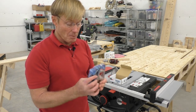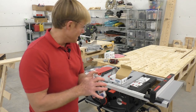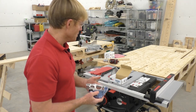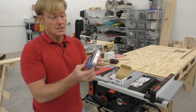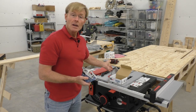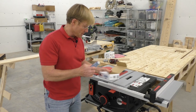These are obviously one-time use — they plug in. Once they come in contact with the blade, it damages the blade and the cartridge. But then you just pop in a new one and put a new blade on and you're ready to go. I have an extra — this one is actually designed for the 8-inch dado blade. So if I want to set this up for dado, I would swap this out with the other one that's in there, set up for the 10-inch.